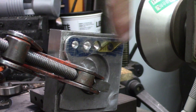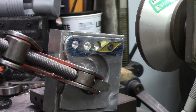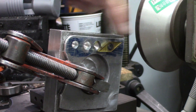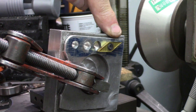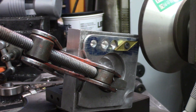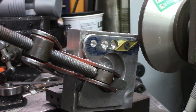I need to make the top of the insert completely flat. This is for an upcoming project. With wood, carbide inserts are not really the best — the way they are shaped and sharpened for steel means they won't work at all. They need to be very sharp at the ends, and that's what I'm going to try to do with this setup. First step: diamond wheel with holding setup and the grinder. Let's see how it goes.